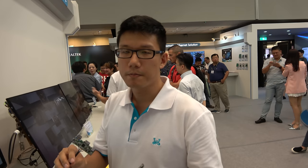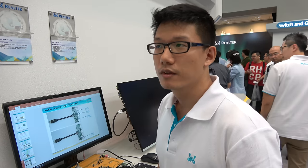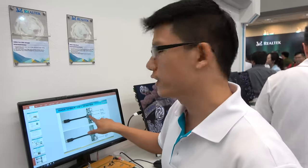It's the Type-C protocol — everything is digital. The protocol is translated digitally and it's very fast because Type-C is USB 3.1 spec. This particular solution runs at 5 gigabits, though USB Type-C can support 10 gigabits. To reach 10 gigabits you'd need to change the hub, since this one's rated at 5 gigabits.